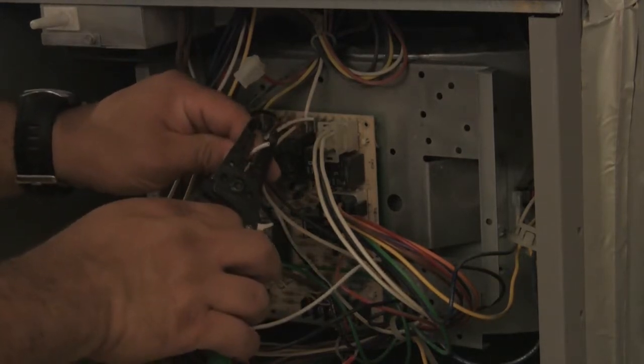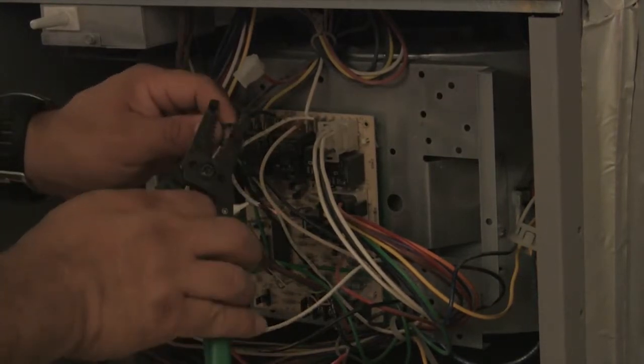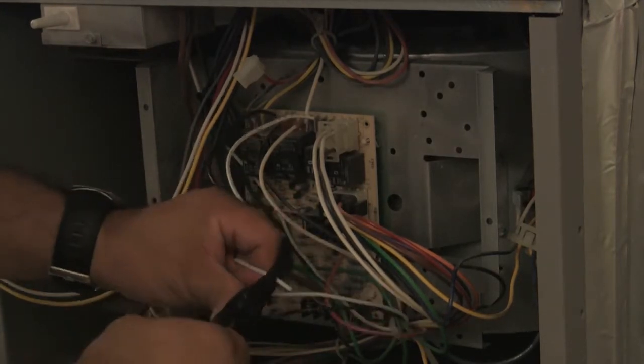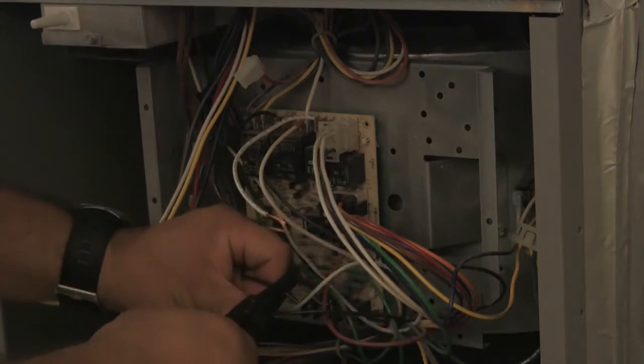You are now ready to make your wiring connections. First, prepare the power wires to be used. Then connect the white wire from the FA unit to the neutral on the system, and connect the black wire to the 115 VAC power wire of the furnace.